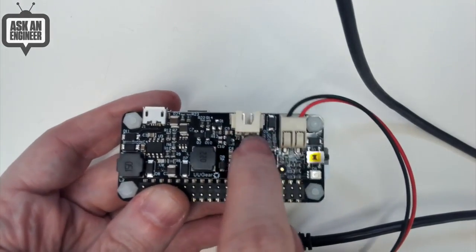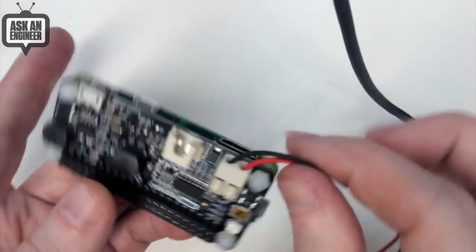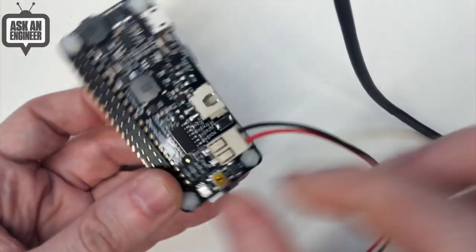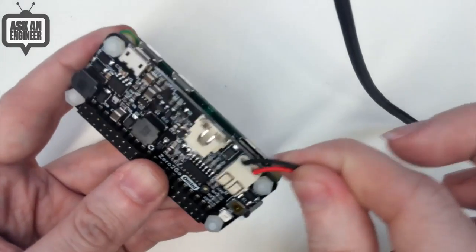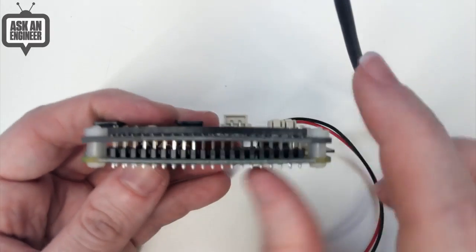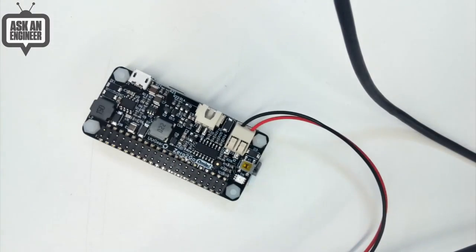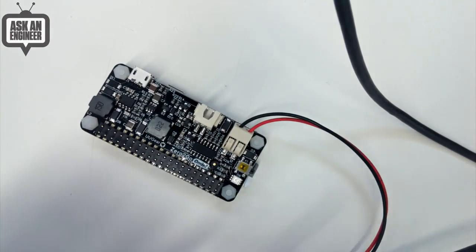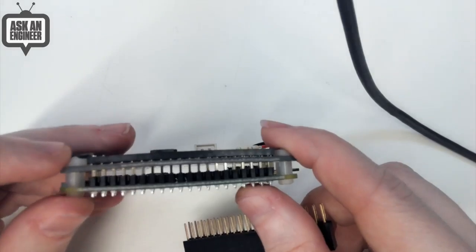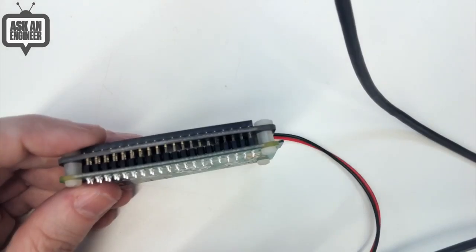Input number two has a 2.54mm (0.1 inch pitch) JST XH connector — you can fit a proper XH connector in here, available online. The third input is a terminal block: press to release, snug in here, and it works with any stranded or solid core wire. It's normal bonnet style so it comes with standoffs and plugs right onto your Raspberry Pi. Note: if you're using this with a Pi 3, you'll want one of these lifters because it sits so low it can bump into the camera connector.